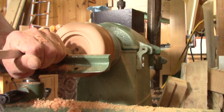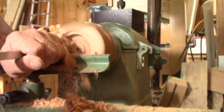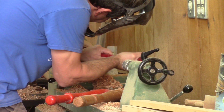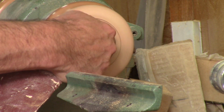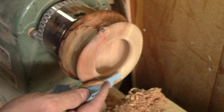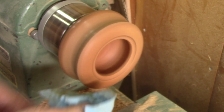As a matter of fact, for me, this is the most difficult part of the process. I never know when it will jump in my face. Plus, it's not that easy to see what I'm doing. When I'm satisfied, it's time to sand the part without any finish on. And just like for the other side, I polish it with an abrasive paste, followed by a shellac finish.